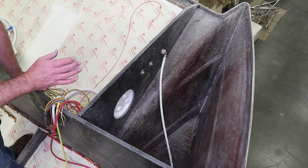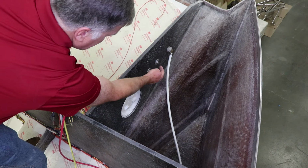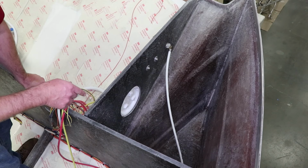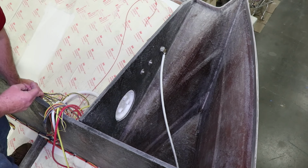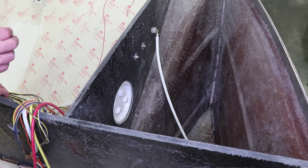Here we're looking in the starboard bow, and some of the fun things here, you can see the aluminum reinforcing continues up through there. You can see the back side of our bitter end cleat and the big fender washers. You can see that we've put in a pipe for future access to the wiring and lights that might be in the deck. But the most important thing here is the nose of this is boxed in to this bulkhead, and then we foam fill underneath it. So the first 2 feet of the bow of the boat is foam filled, boxed in with Coosa, super strong. And then the nose is also Kevlar reinforced. So this is an incredibly strong part of the boat, but when you hit a big log in the dark, like I've done at 17 knots with a boat like this, it's nice to know that nothing bad's gonna happen.